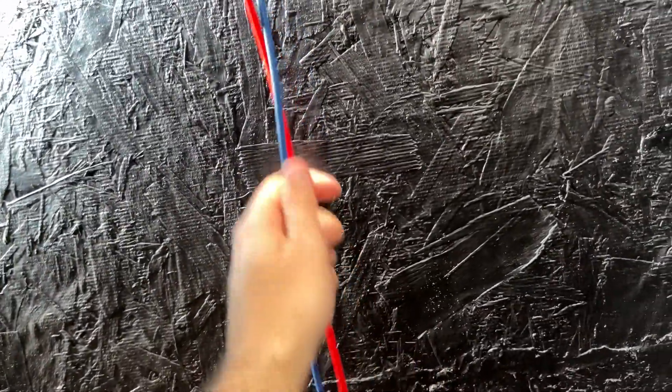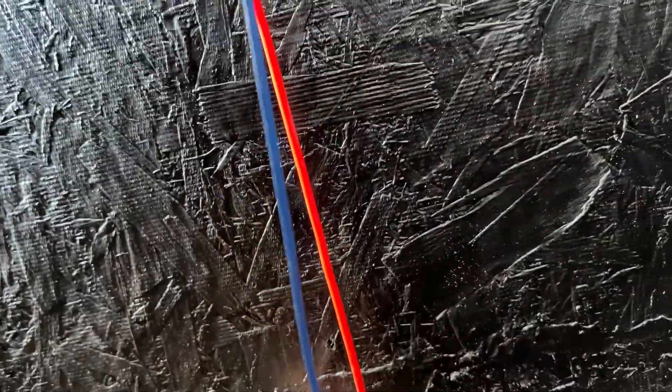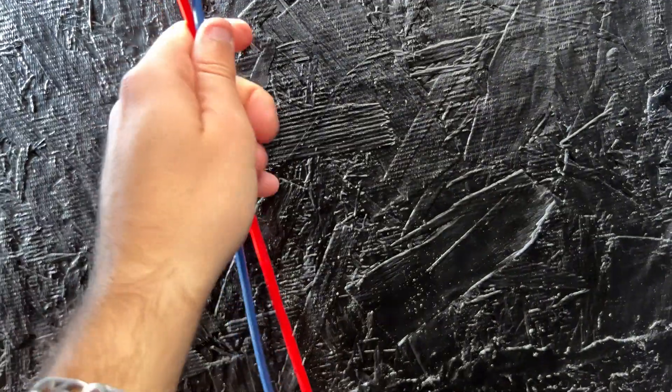So this is just a quick video. I'm going to start on the full solar walkthrough next. The awesome thing is this 10-gauge wire is hardly even warm — actually, it's not even warm. The other wire we were using was just some speaker wire for testing, and it was pretty hot. The charge controller was throwing codes and the end of the wire was actually burning up, so we grabbed the 10-gauge and updated it quickly.